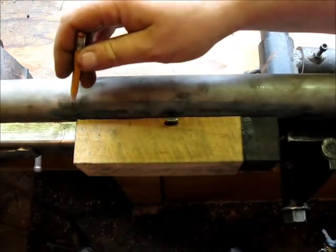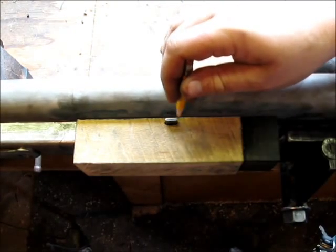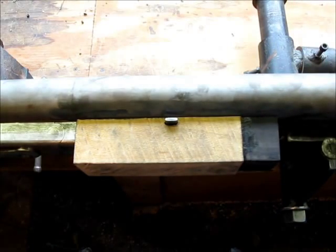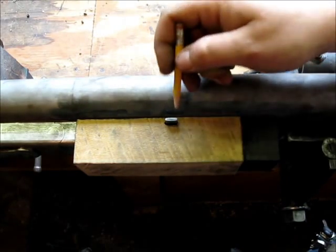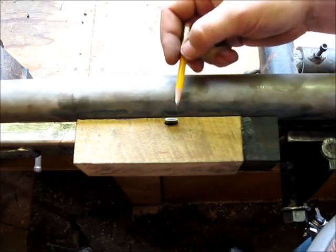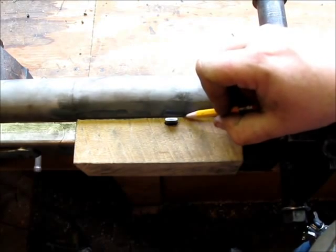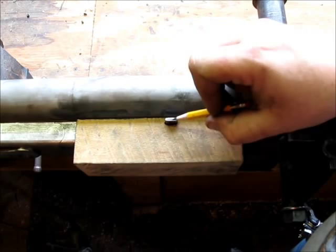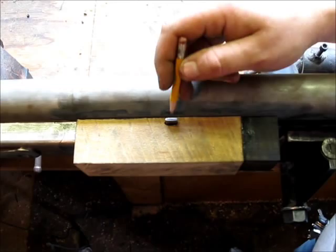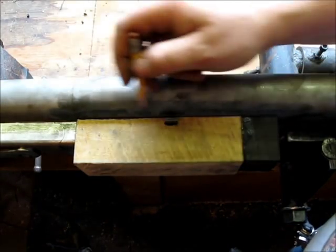The forearm is all done — completely inletted, glass bedded, and I drilled a keyway for it and stuck the fitting key in there. I did the keyhole the same way I did the tang bolt: drilled from both sides between centers. Works real good, gives you good alignment. The measurements were easy — I just measured off the wood-to-metal fit and measured down to where I needed to start. Opened it up a little with the Dremel and ran the key through. Fits real nice with a tight fit.